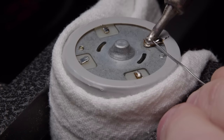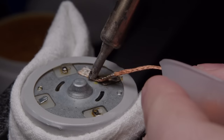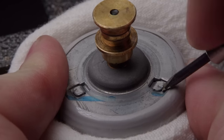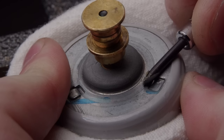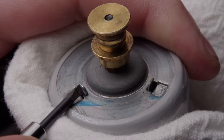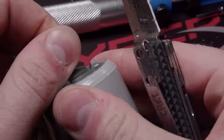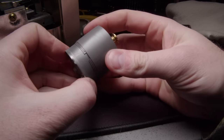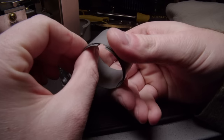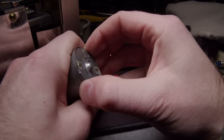I'm going to start by cleaning off this solder - not really necessary, but just to make my life easier when I have to re-solder it later. Just sucking that solder off, and there was a pretty big blob on this bent-over tab so I'm cleaning it up. My first approach to taking apart this motor were these tabs - the only things I really see - trying to bend these up to see if that maybe lets the motor slide out. It didn't. So I'm removing this plastic covering, and it has this metal shielding on it - I'm guessing it's some kind of electromagnetic interference shielding.